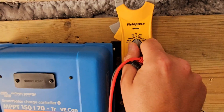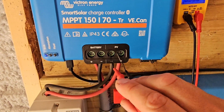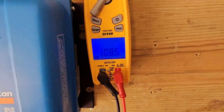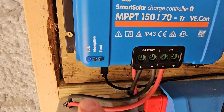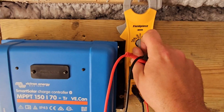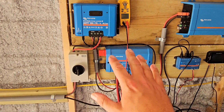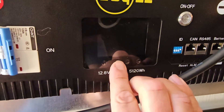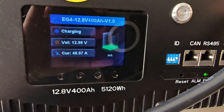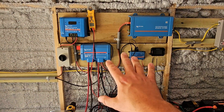Now let's recheck volts DC — let's check our voltage and then our current. PV: 108 volts. That is much better — 108 volts. You can see it's in the bulk charging stage now. Before, we had too much voltage and I'm sure that's what was limiting this charge controller from working properly. Now it's not going to overheat. Let's check the EG4 400 amp hour battery and see what our current is — 48 amps. That is great. Now this is going to work so much better.